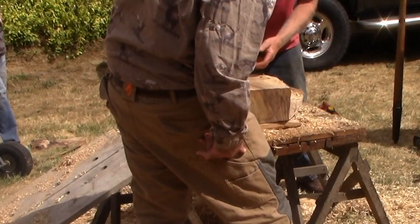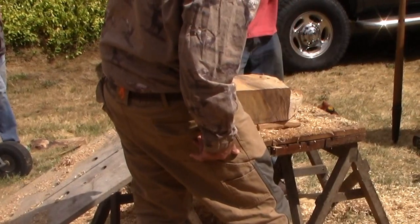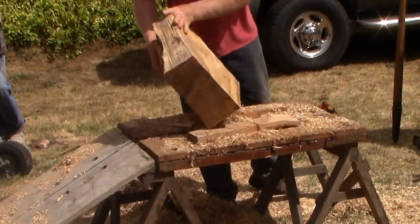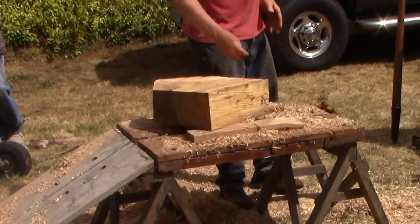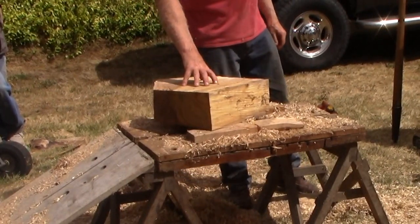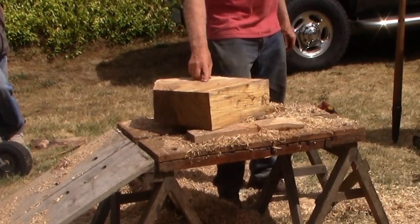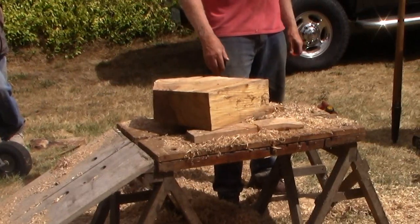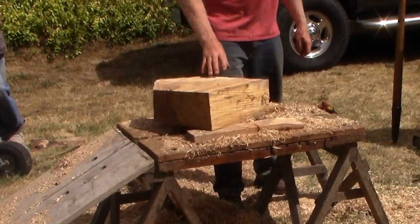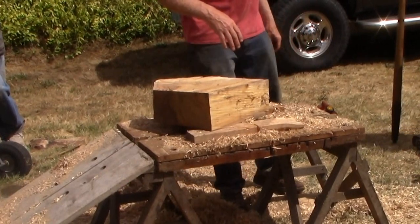But this will be the top. Do you sacrifice some of the feather to put a tenon on the bottom of the bowl or use a different technique? That's a good question. So when I rough out, I use chucks, right? I would use a bigger chuck and I would just grab this so that the center is not turned out. You understand what I'm saying? So I'd use maybe number 4 jaws on a Stronghold, which is pretty good size, 5, 5.5 inch. And I grab it with that. Or go recess? No, I never do recesses, never.